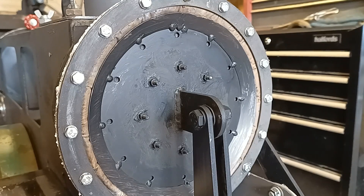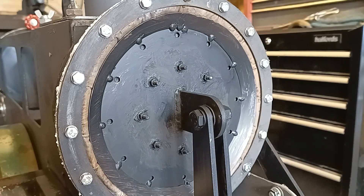The next change — I've actually put some supporting rings on the piston plates. I did have a nylon ring here back a few videos ago which I removed, but since I've changed the diaphragms to Kevlar, I believe I can put that back now. The idea is it actually supports them as the piston goes all the way in, pushing that last bit of air out so you get less bulging in the diaphragm.